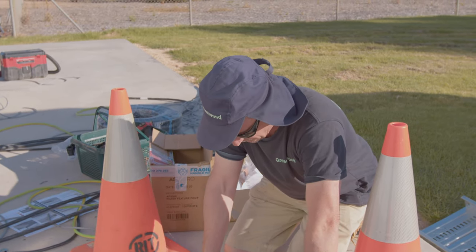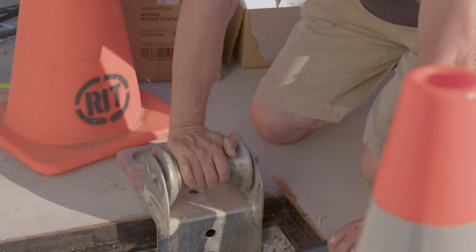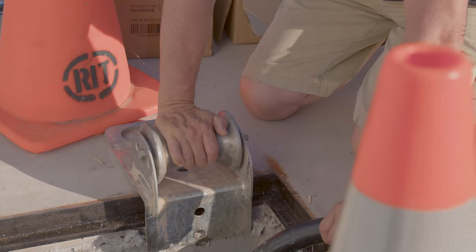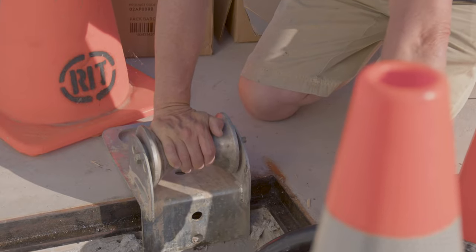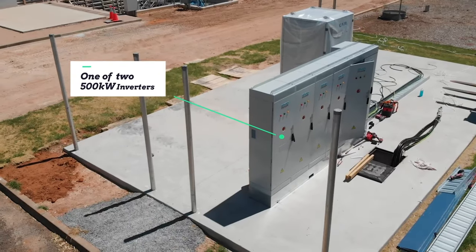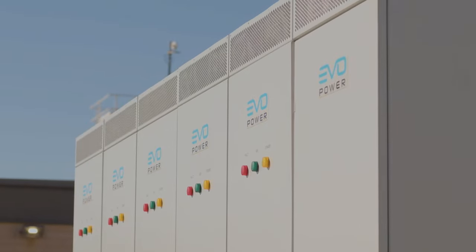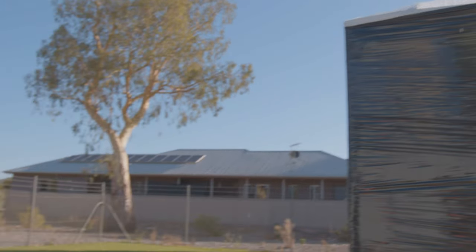The rollers reduce the stress and friction on the cable. There are internal systems where you can put quad rollers or double rollers inside the conduit, which would probably make the job easier, but we didn't have those. Now we're here at one of the inverters — this whole inverter here is 500 kVA. It couples up with one megawatt hour of battery storage, and there's the unwrapped battery storage system — that's one, and this is one of them over here as well.